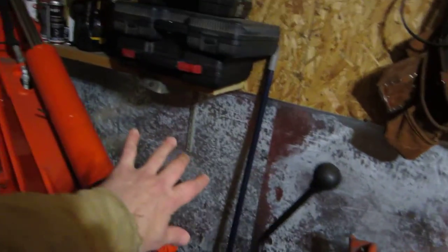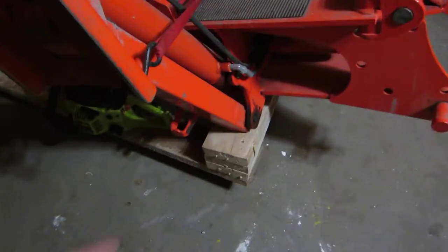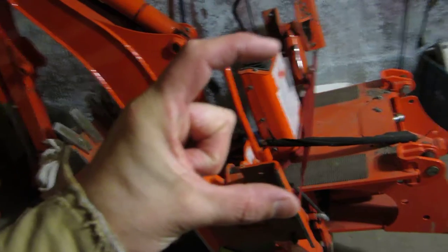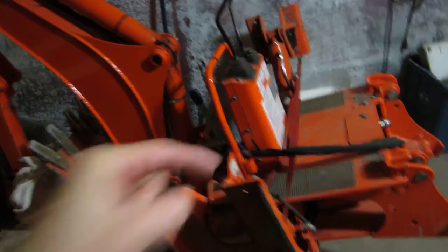You roll it up until your things are right in the seating, connect your hydraulic hose, push your boom forward, and it pushes right up into place. Lock your pins and away you go — it's really that simple. It took me not even 15 minutes to build. I screwed it together with just normal square-head wood screws. The casters I put on with a good 3.5-inch wood-thread bolt on the four holes. There you have it — dolly done.